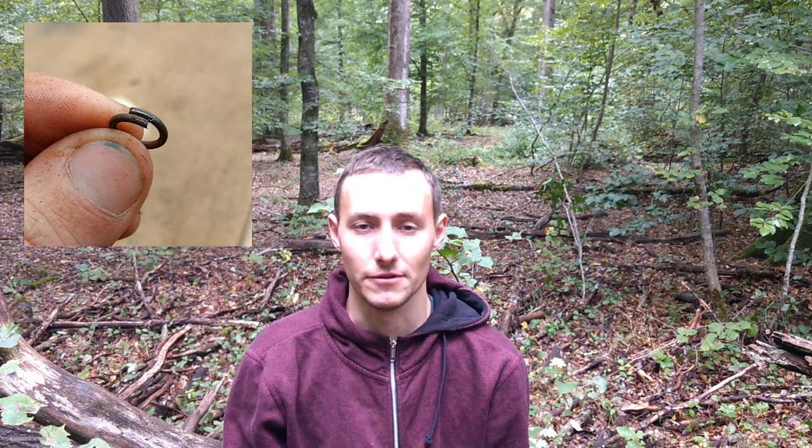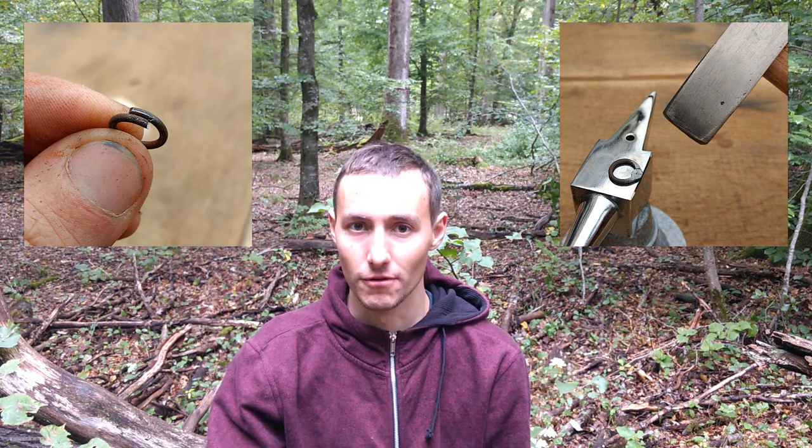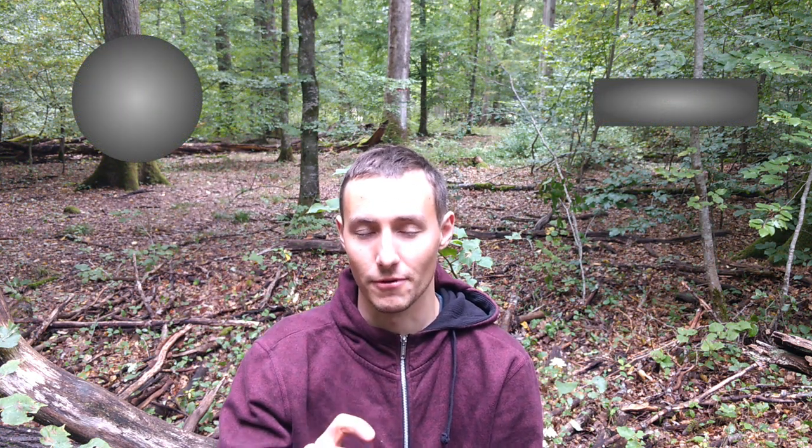What are the differences between the two, if you look at the manufacturing process? The wire is round, so all it needs to turn that into a flat ring is a few more strikes by hammer — you flatten the entire ring, not just the overlapping area, and that creates a flat ring. But flat ring is not flat ring; it depends how far you flatten it compared to the round cross section of the wire it had before.